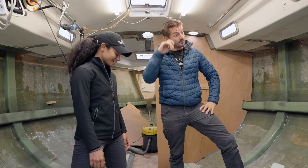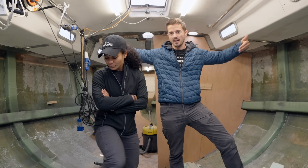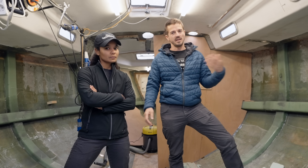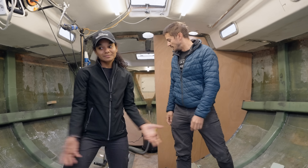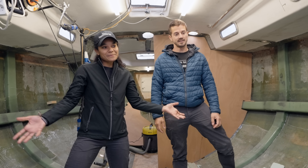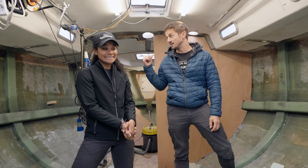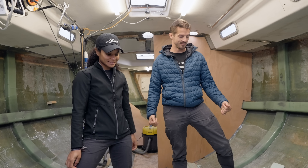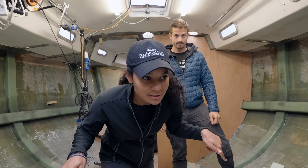The dimples are basically gone. There's still a little bit of a shadow — when the sun hits it just right you can kind of see that instead of a nice curved hull it's a tiny bit flatter in those sections where the knees were dimpling in the hull. But that's going to be easy to grind out and fair on the outside when we paint. Lots of work to slowly get done but it's moving along quickly and we're excited to get the rest of the glass in.